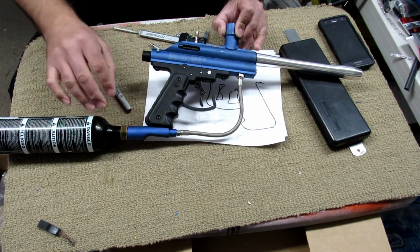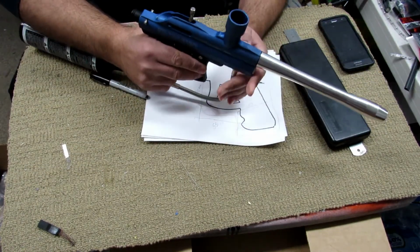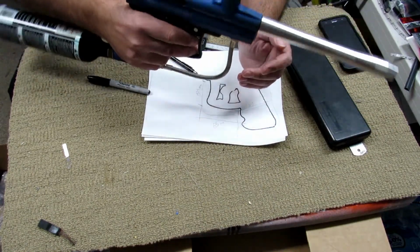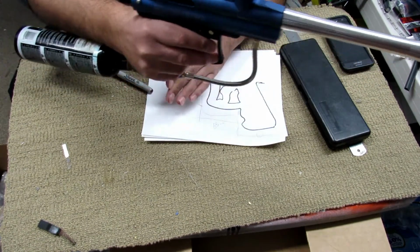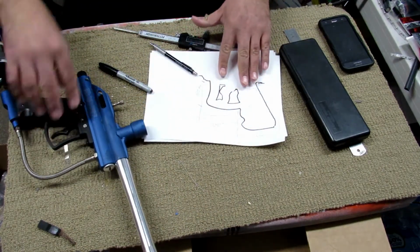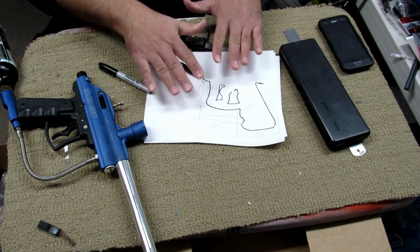And again, as I was mentioning earlier, we're going to put it on a Lazy Susan. A Lazy Susan is 2 plates, a round plate with bearings that will let it go left and right. And we add another servo mechanism to the system so we can control it left and right, and another pivot point to go up and down. But this is the basic, just a really quick how to think about doing that.